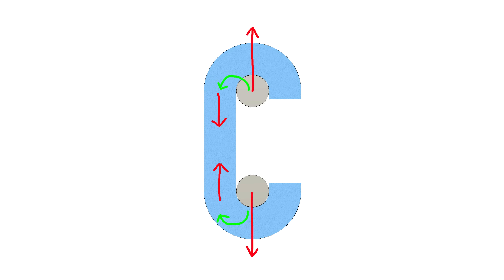Their rules were slightly different because designs only had to prove they weren't a closed loop — they didn't actually have to open to mount the shackles, which adds another level of difficulty. In an ideal world, a solid loop would be the strongest design, as the tension on one side is balanced by the tension on the other, so there are very little bending forces. However, our design has to open to accept the 8mm shackles, creating a C-shaped hook, which is far weaker as there isn't just tension in the vertical section, but also bending forces created by the offset between the upward force of the shackle and the downward force of the tension in the hook.